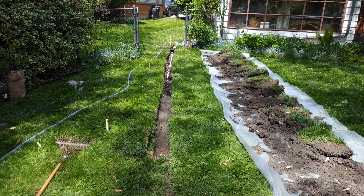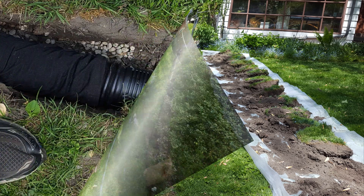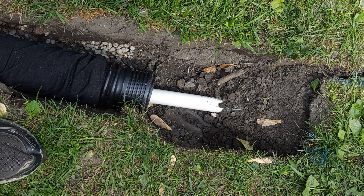The worst is over now. Here I've got it filled right to the top, just about to the point where I'm going to join my 1-inch pipe into my 4-inch mole pipe. What I had to do was buy a cap for the end, drill a hole offset so it's at the bottom of the circle, slide it into the mole pipe, and then my 1-inch PVC pipe slipped into it. So that was my reducing coupling.